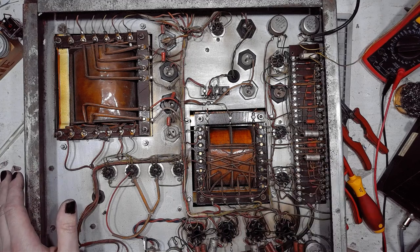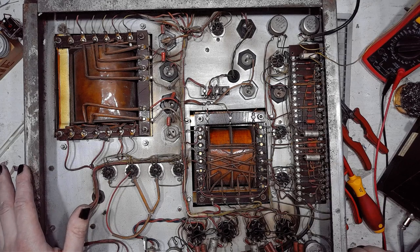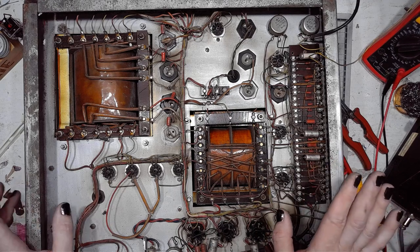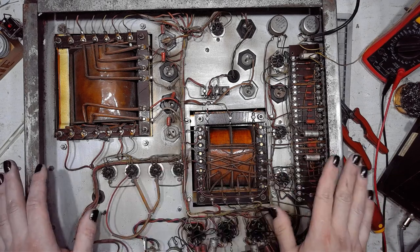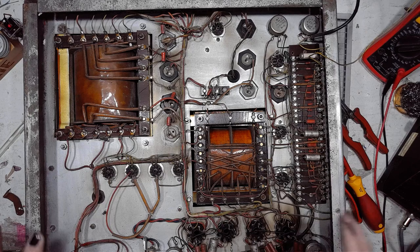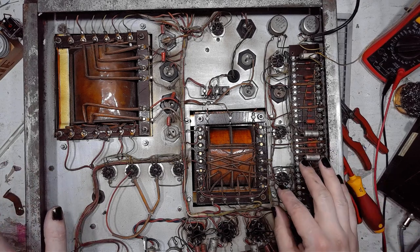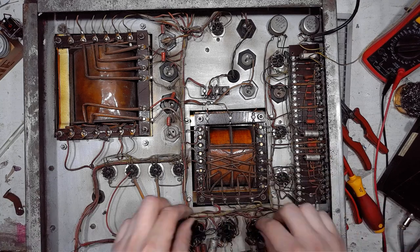and practice on all of my amps that used fixed bias. I'm gonna make it in such a way that whenever the wiper loses contact with the track, then the tube gets the maximum negative voltage on the grid, and that's a fail-safe design. Rather than killing the tube, it will just cut the tube out of action, making it pass a negligible small current.